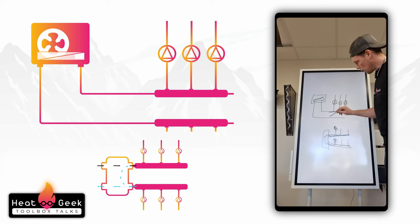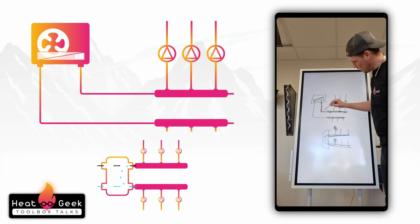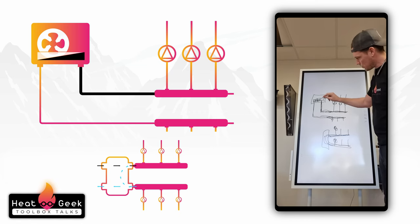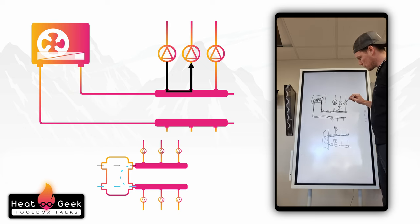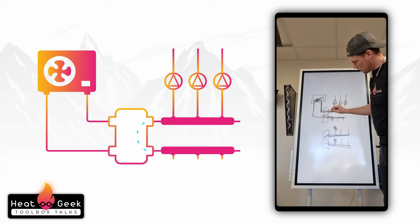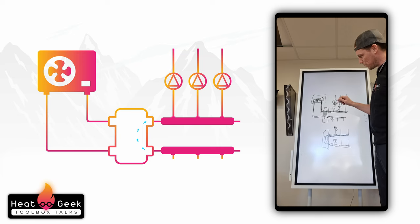On a heat pump, although we've got distribution lines, this part of the circuit — even up to here — we could have large pipe, but the plate heat exchanger is high resistance. So the pump can't put on its own return back around here because it's being restricted. Instead it'll put on this pump, and if there's a change in demand or it comes on or off, it'll put on both of them. So we have to put a low loss header in and complete the circuit — there's no point doing a distribution header without completing it to its own return.